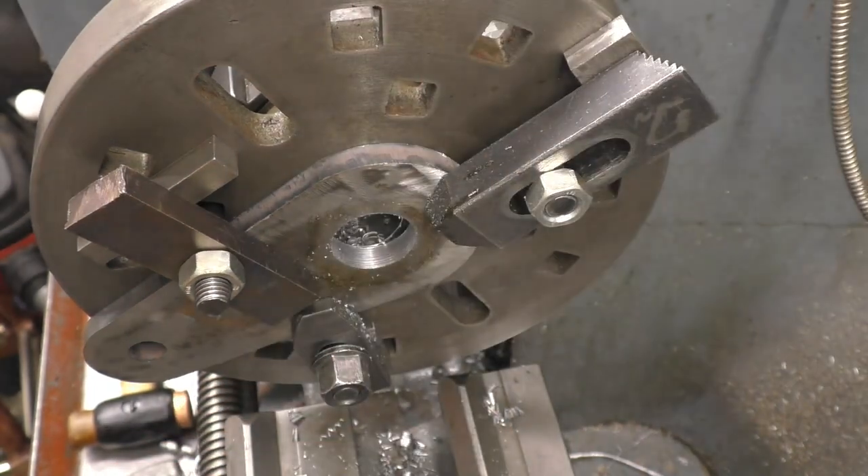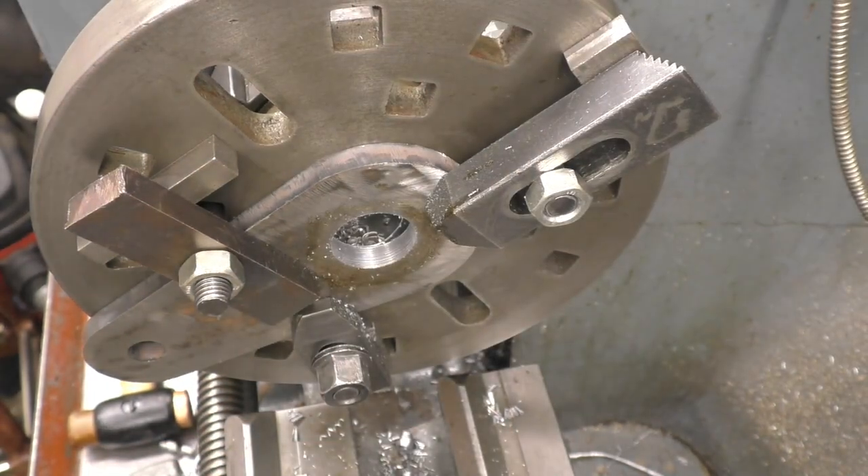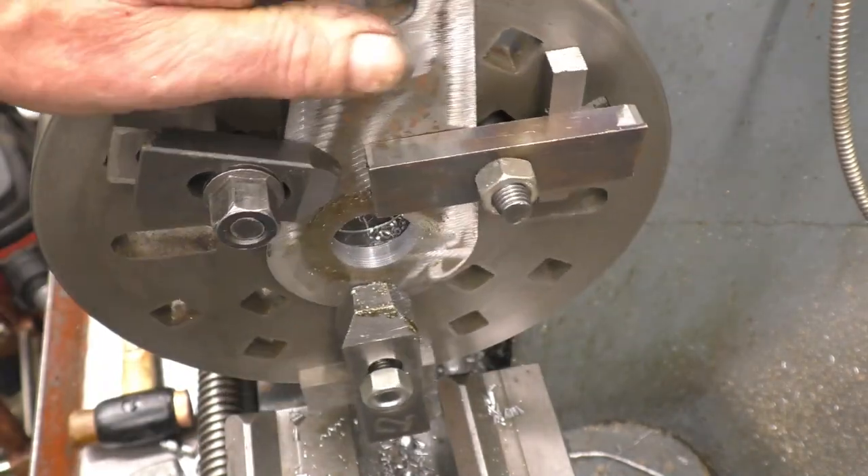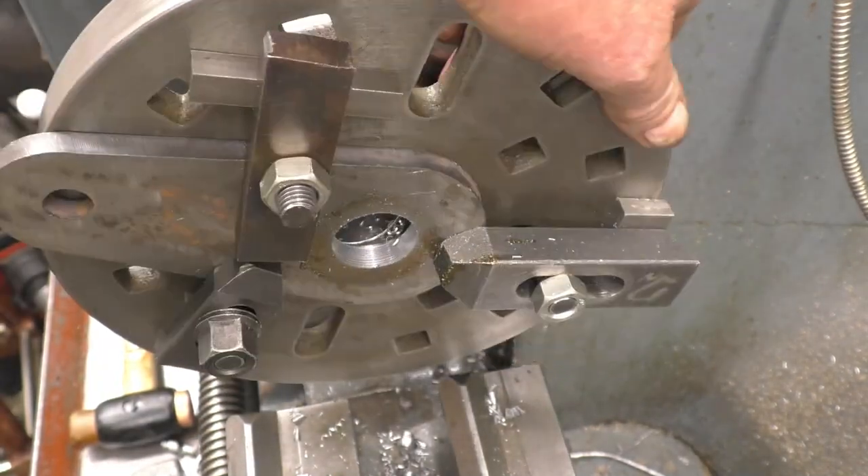Right, we've got 31.2mm — that's certainly big enough for the pin. It's enough for what it's got to be. Like I say, it's going to have a pin welded in. Now it's a case of turning it round and doing the other hole — one exactly the same.